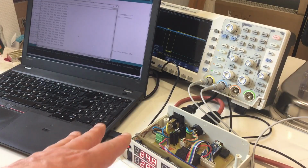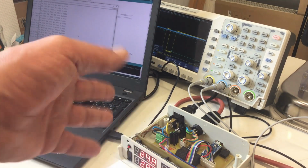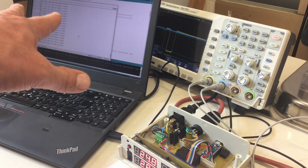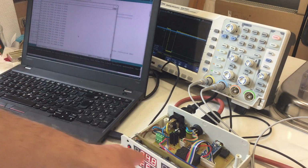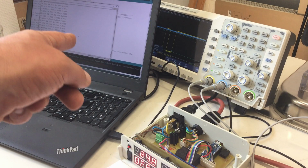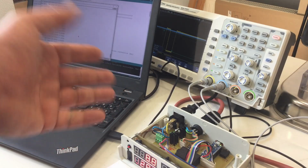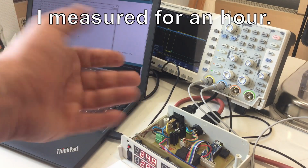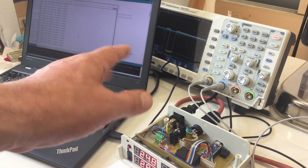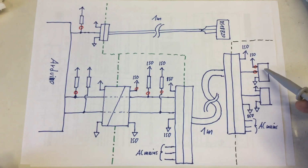if I have connected everything right. I admit I'm at a total loss here, so I decided to let the serial monitor on my notebook, connected via the USB port of course, monitor the values I'm reading on all 3 sensors, and I will do a little statistic seeing how often that error, that intermittent error, occurs within about half an hour. And yeah, from there I will decide how to proceed. Attention, probes are now back at the DS18B20, signal and power.